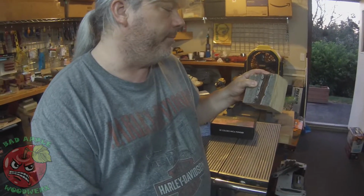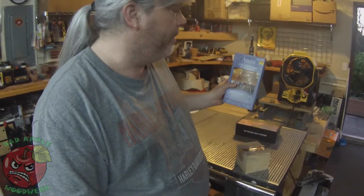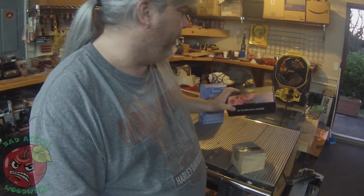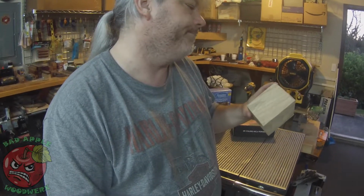It had a pretty big crack in it, you can see right there, just a really large crack. So I poured some resin, just using this Alumilite Amazing Clear Cast. I got this at Hobby Lobby, and then I ordered these mica powders on Amazon, and used a root beer brown to mix it up, pour it in this crack to fill it, and then let that sit. This has actually sat for a little over a week now, probably about a week and a half for this piece. And so it should be getting dry by now.